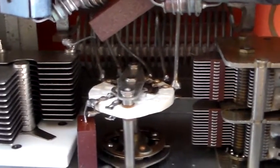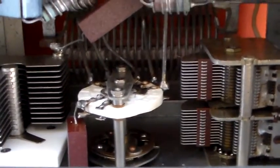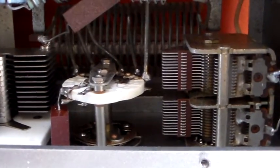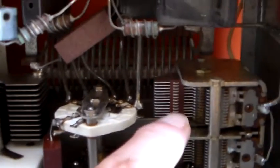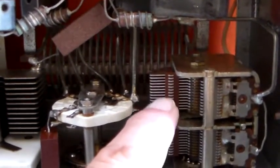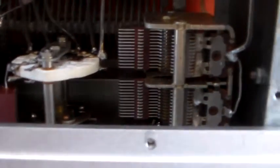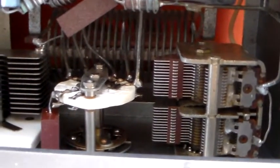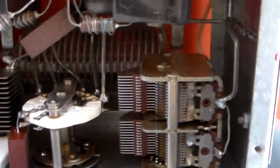Back in the 60s and 70s people used to tune these straight into the wire using the tank circuit's wide impedance matching range and forget the ATU. But the higher the load impedance of the antenna, the higher the voltage across the capacitor. With five or six hundred watts output — which this unit is rated for — I wouldn't be deviating too much from the 50-ohm load; I think it would arc fairly easily.